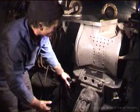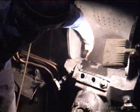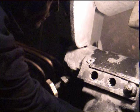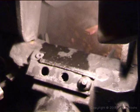These on the side are your vanes. You'll see inside here, there's one, there's two, operated by that. That adjusts how the coal falls onto the table and how the steam blows it. So if there's too much coal going into the back corner, you can either cut down on your jets or turn the vanes in. These over here will guide it away from the back corner.